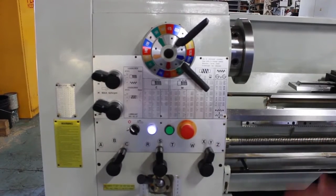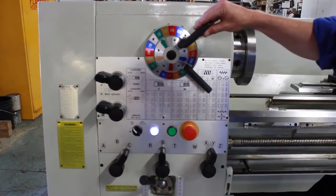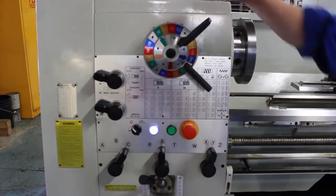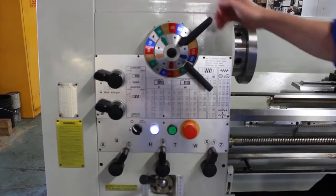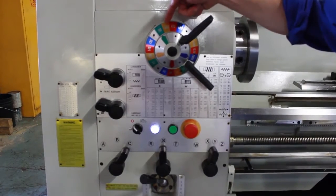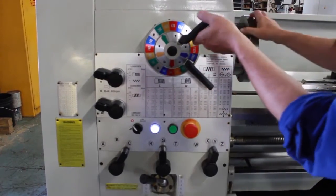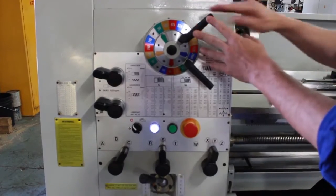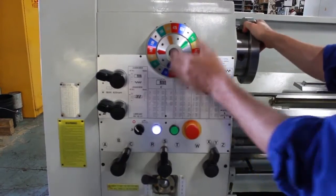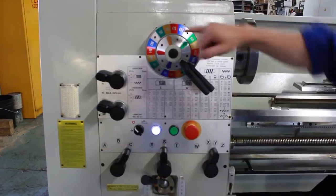Once the machine is ready to operate, you usually want to choose your RPM, or what the spindle will run at. Right now the spindle will run at 260 RPMs, as indicated by the green lining up with the green on all three pieces. If you wanted to change it, you simply move the dials around so the colors and the RPM match what you want. For instance, if we want to move to 360 RPMs, we simply move everything so the orange colors line up. As this is a geared head lathe, if it doesn't engage right away, you simply move the spindle around and the gears will line up — just as that occurred right there. Now we have all of the orange lined up, so 360 RPMs is what this lathe will operate at.